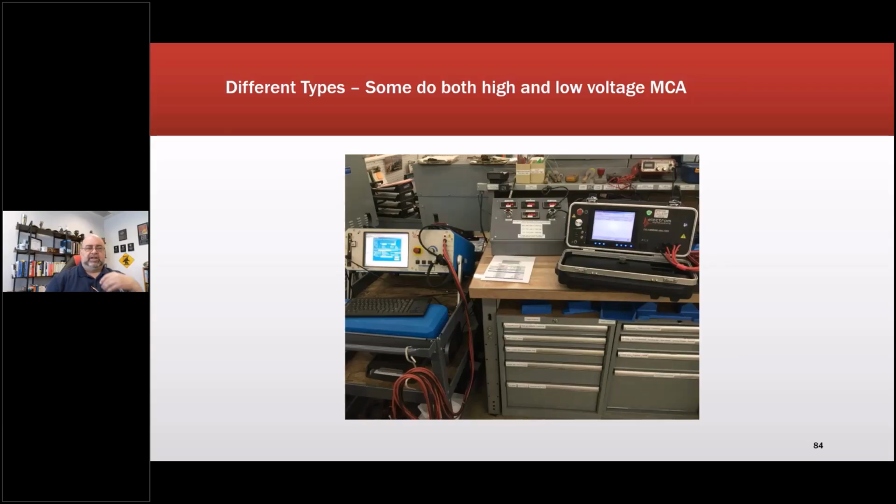I think the argument right now within that group has to do with machine rotors that are edge wound or even round and square wire, because the OEMs had convinced everybody that those should not be included in any type of insulation resistance, or I'm sorry, in any polarization index test, and that the insulation resistance value should be ignored. And all of us fought that. It got pushed through anyways.